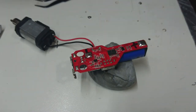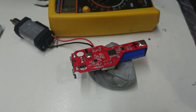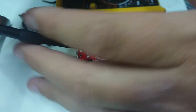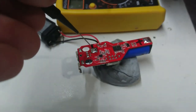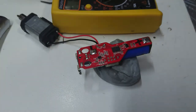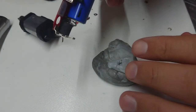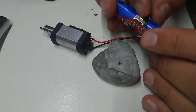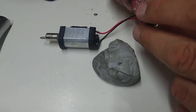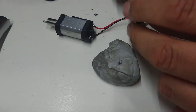We'll leave the extraction fan on for a couple of seconds. Next thing we're going to do is get our cheapo meter - my good expensive one lives in the vehicle, I should add that to my shopping list and buy a decent extra meter. Let's check this tab and this tab - polarity is correct and it is on 3.8 volts. Let's turn the extraction fan off and see if our motor turns on - which doesn't appear to be turning on. I hope we didn't cook anything. We might give it a jump start with the charger and see if that fires it up, hopefully giving us a working pair of clippers.